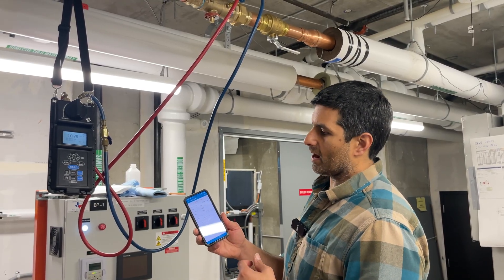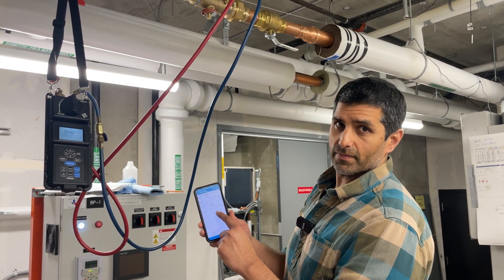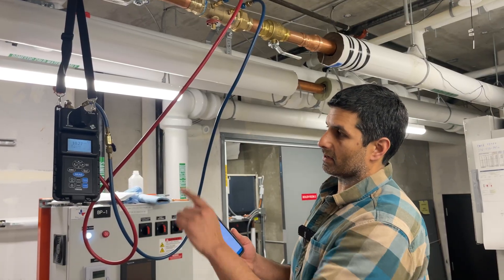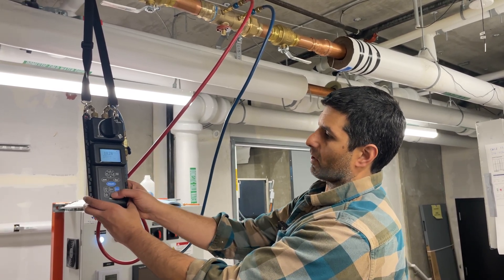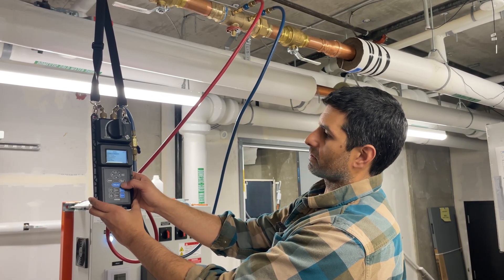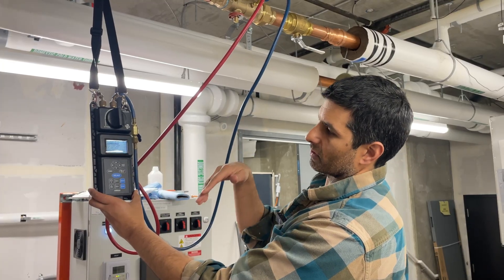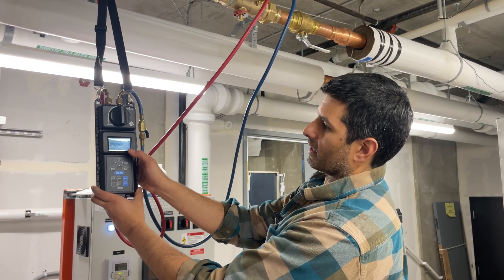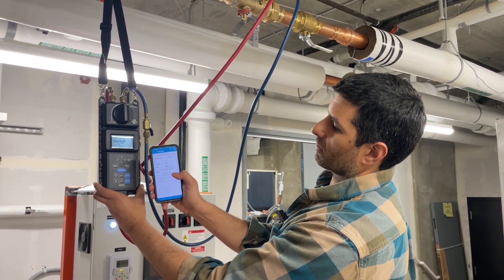One thing I can point out is that at a given setting of the valve, there is a characteristic value called the Cv value, which the app will tell you. That Cv value is static for a given setting of the valve, and this manometer actually has the feature of setting that Cv value and having the flow read out right on the display. So going to menu > flow setup > select Cv/Kv factor — it allows you to have multiple factors set. We're going to use number one. The Cv type, with an entered value of 3.2, comes from the valve manufacturer — in this case the Cv value for the flow setting of 50.